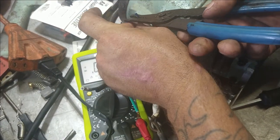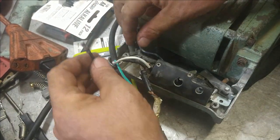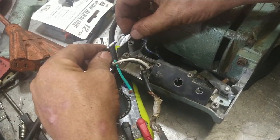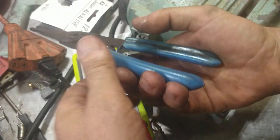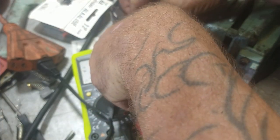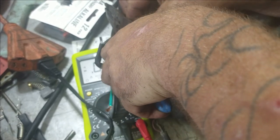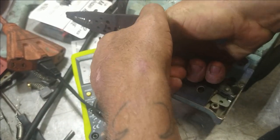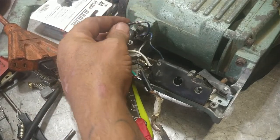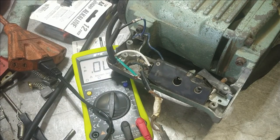I'm going to splice this guy out here. Get him into the butt connector. A little bit of wire showing so that we can solder it to the wire too. So, make sure these are nice and crimped tight. There we go. Then we're going to take our solder gun. Set it up here. Getting nice and hot. Hold on, where's my solder? There we go.